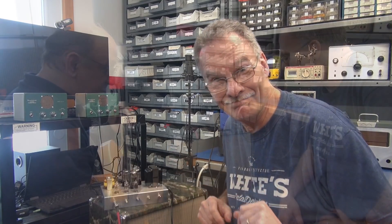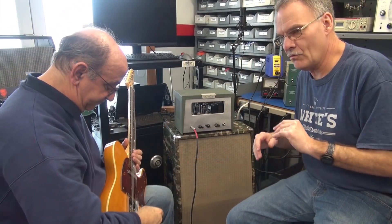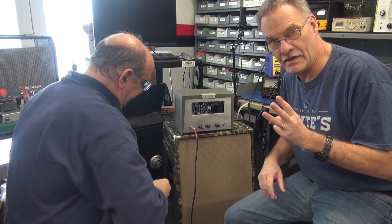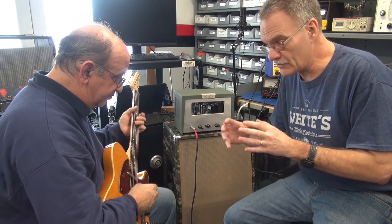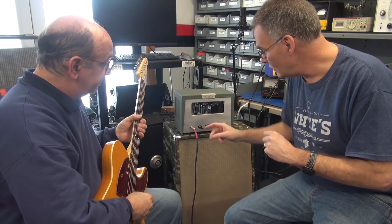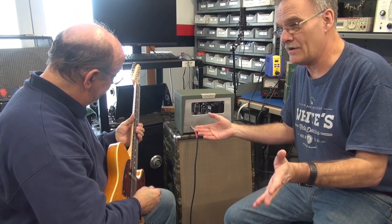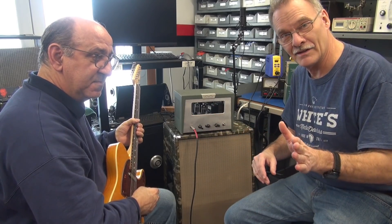Hope you guys enjoyed it. So I've got Tony in the shop and we're going to show you an experimental amplifier running three 6SN7 tubes all in parallel — that's actually six triodes connected together — and we're running it with three triodes which is a set of 6AB6 tubes. This is just an experiment. I'm not saying this is the best amp in the world, but it has a unique sound with some traits that Tony kind of likes.